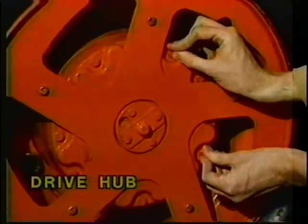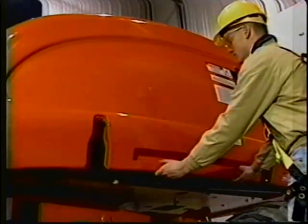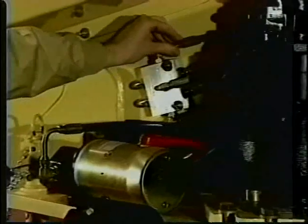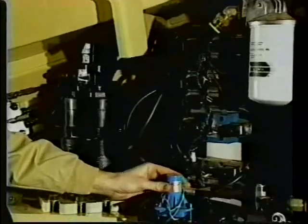The drive hub should have no visible damage or signs of leakage. The wheel and tire assembly should be properly secured with no loose or missing lug nuts or visible damage. The drive motor and brake should have no visible damage or signs of leakage. The turntable lock should be operable with no visible damage or missing parts. The auxiliary power pump should have no signs of leakage or damaged wires. The swing drive motor and brake should have no visible damage or evidence of leakage. The right side hydraulic system components should have no evidence of leakage, no damaged hoses or wires, and all components should be secure.